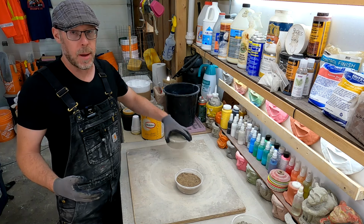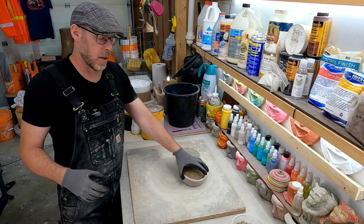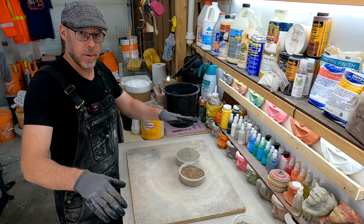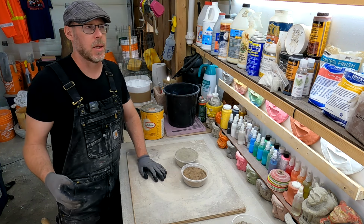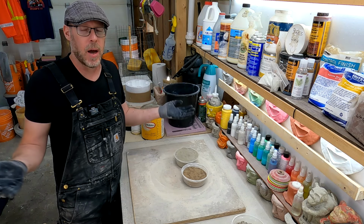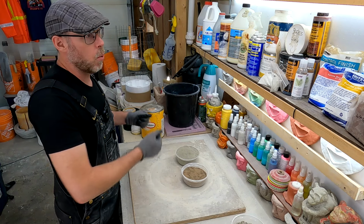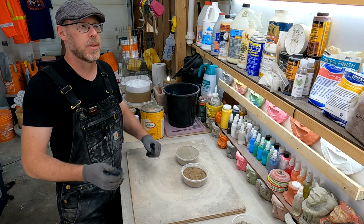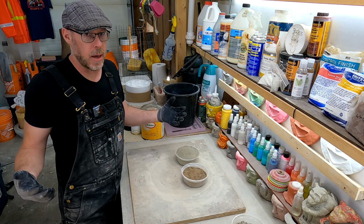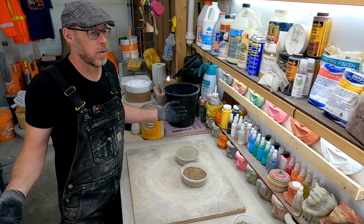So one cement component for this feathered edge mix design, one sand. And ignore the fact that my sand's a little shy here. These would represent leveled and equal. If this were an engineering application, I would hope that you're not getting your information from YouTube, but also it wouldn't just be a scoop or a shovelful. One shovelful of Portland cement and one shovelful of sand are not exactly the right mixture for the best engineered results, but we're not going for that here. If you're just using a shovel, you're just going for close enough.